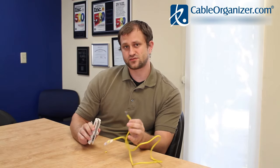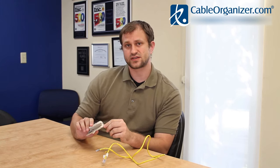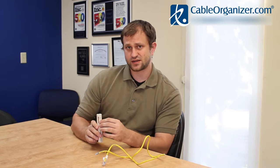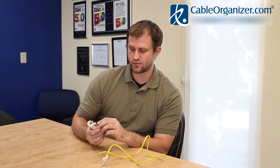The outer cutter that strips the outer insulation requires no adjustment. You can just put any size cable between 3/16th and 3/8th inside the main cutter. The blades on the inside for the conductor, you'll actually have to fit the measurement — we have 0.2, 0.3, and 0.8.